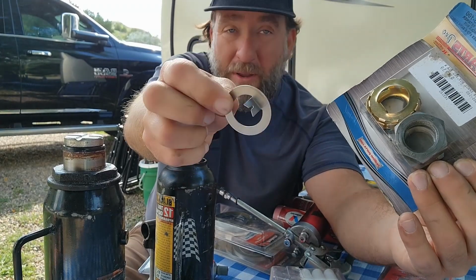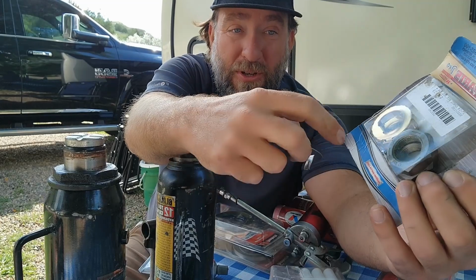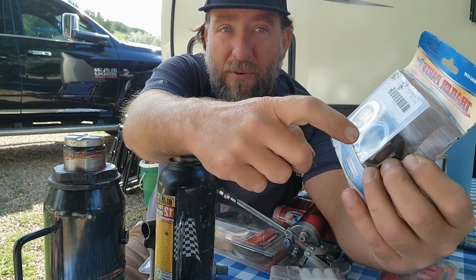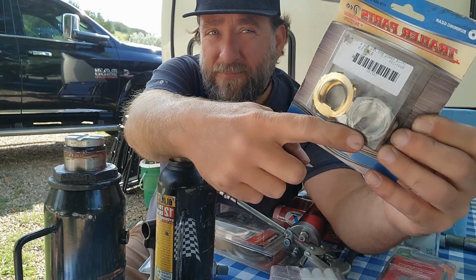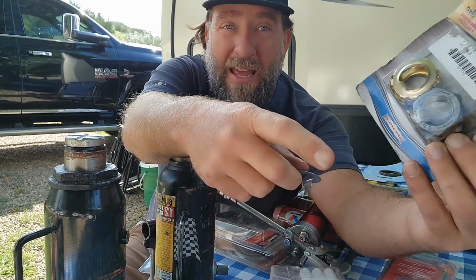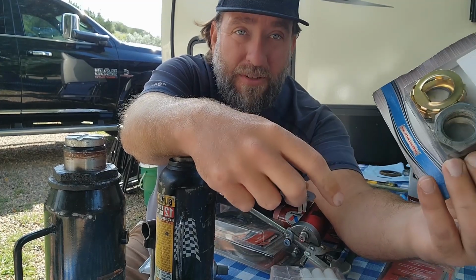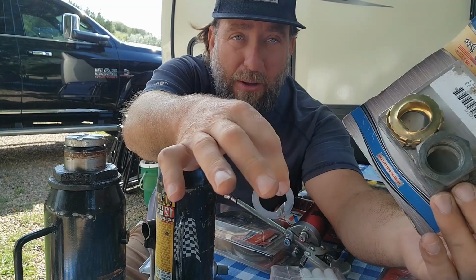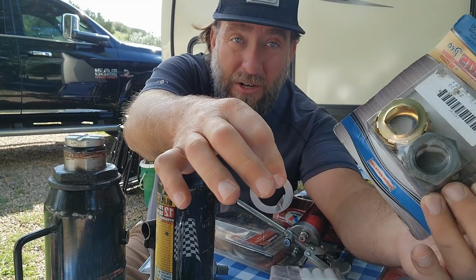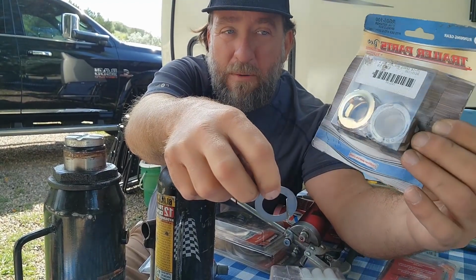And we've been on the road long enough. When we first bought our camper, in one of our episodes you will see, this spindle nut retainer had popped off of our castle bolt, okay? And when that happened, the rotor sat down on the end of the spindle and chewed it off. So we had to have a whole new axle put on our camper. Now, Grand Design did a fantastic job. They were able to take care of us in about 3 days. So that's pretty amazing. They did a really good job taking care of us because of the warranty. But if you ever break down, you just want to make sure you have the extra stuff.